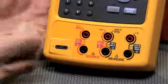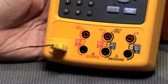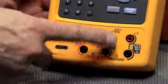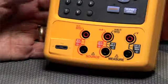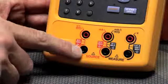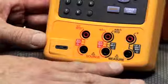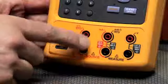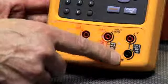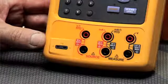Going from left to right, you have the thermocouple mini connector, where all thermocouples are simulated or measured. You'll notice that there's red writing and black writing on the calibrator. The red writing is for sourcing — sourcing volts DC, RTDs, and milliamps. Black writing is for measuring — measuring milliamps, resistance, RTDs, volts DC, and volts AC. The CAT2 300-volt rating applies to these terminals.